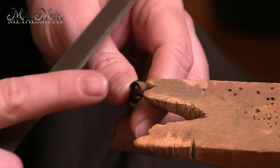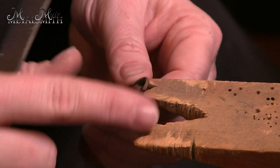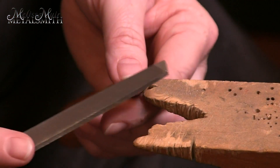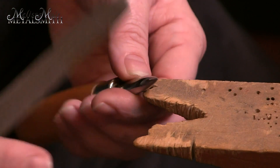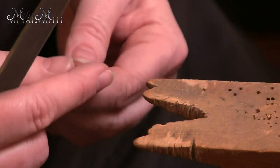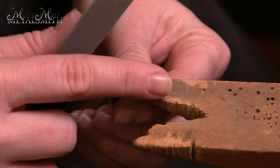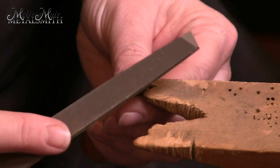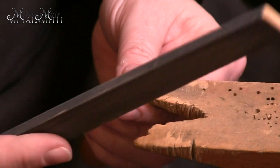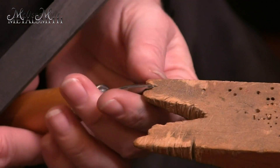What I like to do is just ever so gently take off that sharp, sharp point. I just barely kind of work my way along and will rotate the tool around as I do this, just to take off that sharp point. I like that it comes to a very narrow point, so I don't want to take off too much. I also don't want to ruin or damage the surface of the rest of the burnisher, because on this one I do want to have a nice high polish. I'm only working right here at the very tip, trying not to work down any further than I need to.